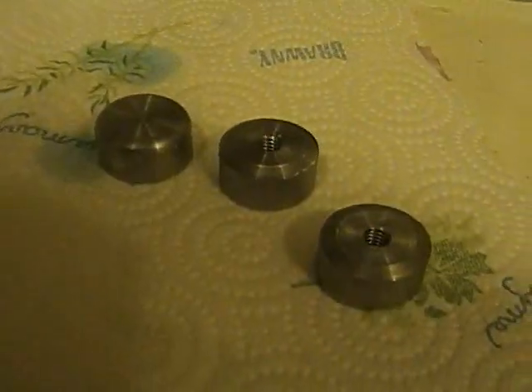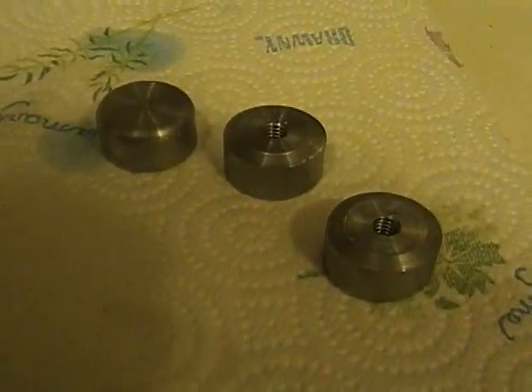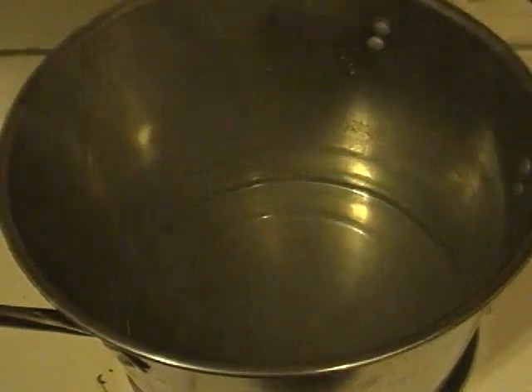Here are the three pieces that we made — I just got done washing them. I used a little bit of Dawn detergent to get some of that oil and grease off. You can see I drilled through and tapped on the inside. I didn't show that because it's kind of boring watching, but yep, all three of them here. This is my parkerizing solution. I'm going to degrease them with a little bit of acetone and then put them in that parkerizing solution.